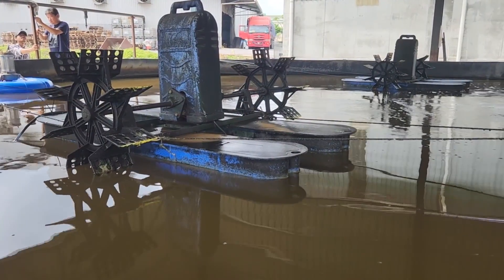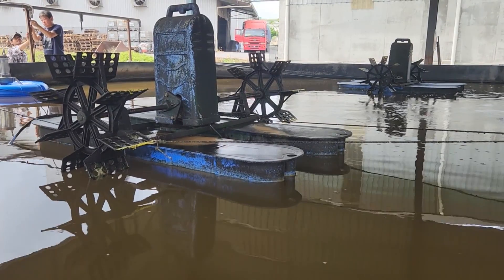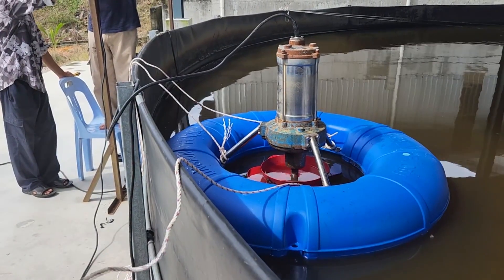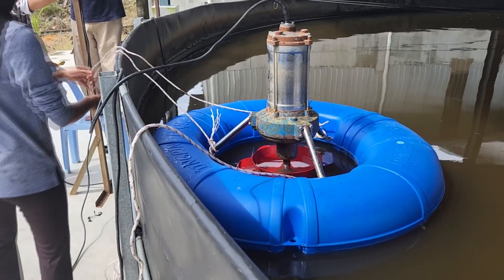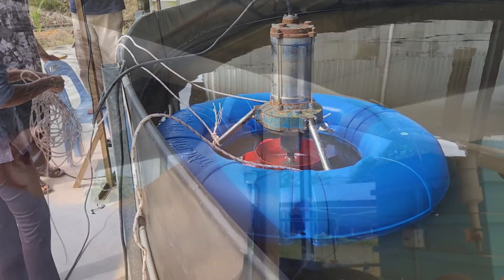In this case we've been using two paddle wheels and a bit of diffuse aeration at the bottom. The first step was to turn off the existing paddle wheels — we did not remove them from the system because we might have to reuse them. We are trying to substitute these two one-horsepower paddle wheels with this wave maker, which is actually two horsepower in power consumption.